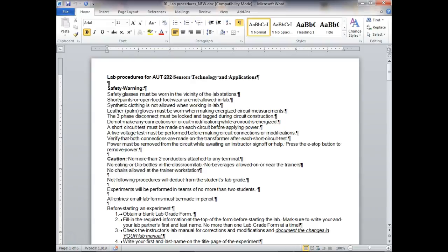When you have power off, use the disconnect. These disconnects are basically the same. On this one I have two keys — one allows us to open it up and open the disconnect, and the other allows me to turn it off and on. It's two keys, and luckily they're the same keys on all of them so I only need to carry one set.